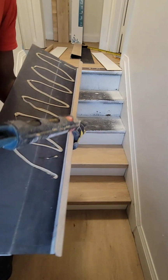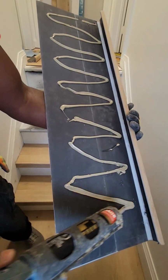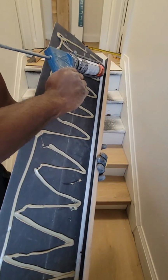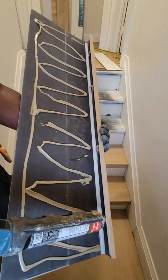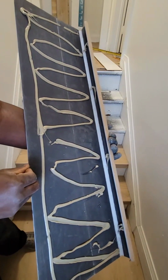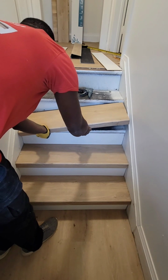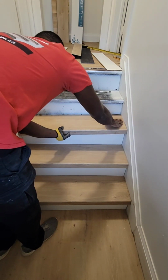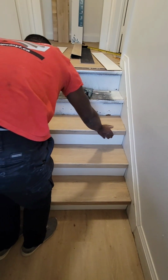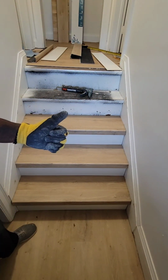So again, we use this tool a lot. These stairs were quite wonky, very well loved and used. And so just getting that into place. The other nice thing about this is that now if the top of that riser, this one obviously was quite tight, but if there was a slight gap or any variation there, it's then going to get covered by the next nosing lip that goes into place. So this is why we insist on having a riser when we're doing our installation. But it's also the reason that we install from the bottom up and to the top.